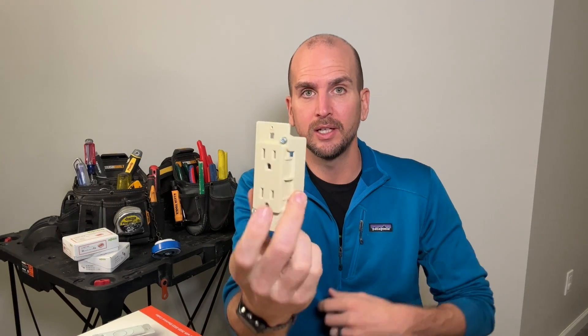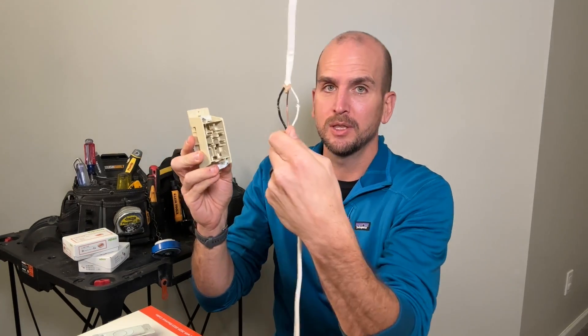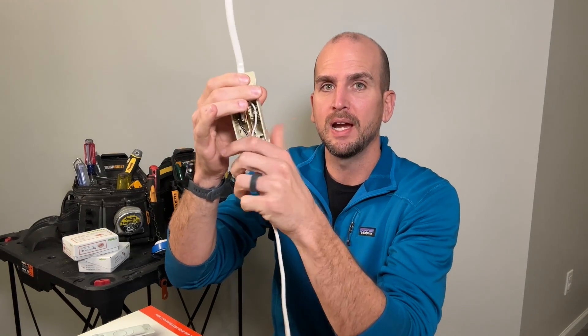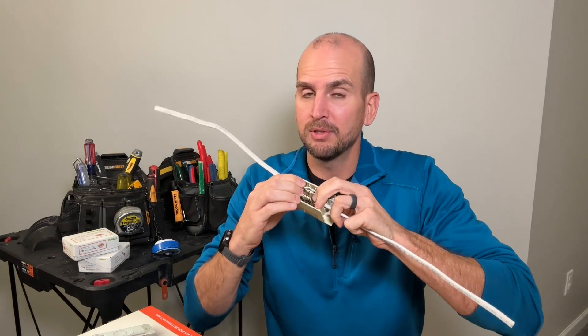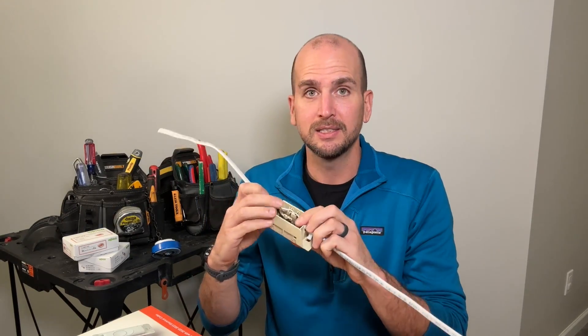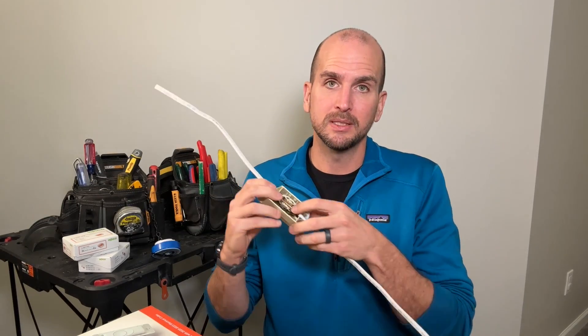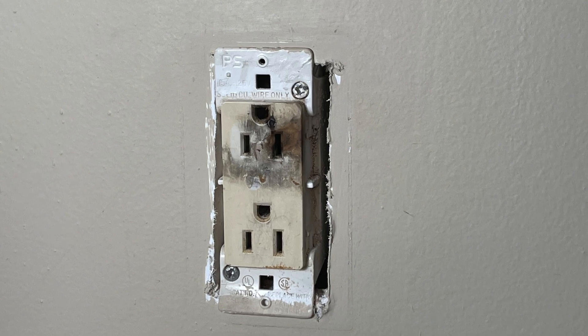Number five: if you're living in a manufactured or mobile home — or family members are — they probably have what are called self-contained devices. This is an outlet where the receptacle and box are combined in one. The Romex comes in the back, you strip the insulation, place your hot, neutral, and ground in the appropriate lanes, and press it down with a specialty tool whose spades cut the insulation and make contact with the conductors. This is not my favorite design. It is approved and still used today, but I've had one fail — someone plugged a griddle into it and fried the outlet, a dangerous situation. Try to swap these out sooner rather than later.